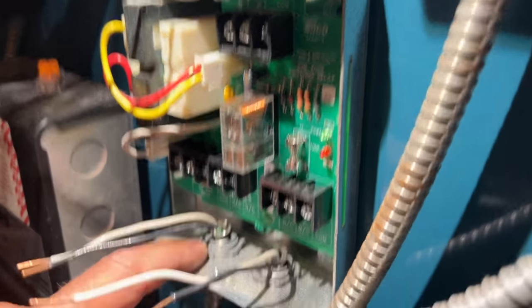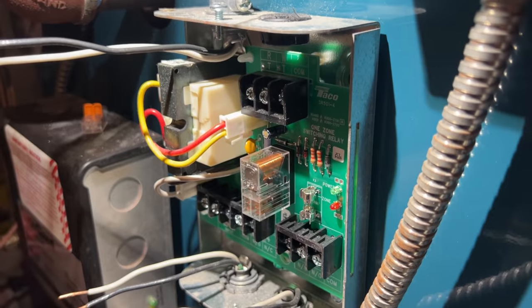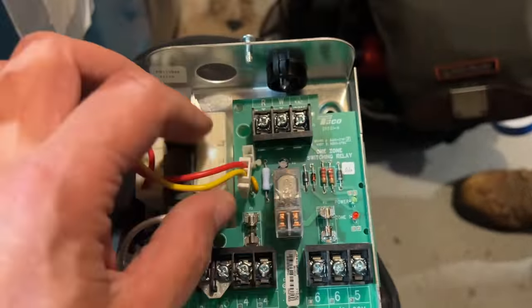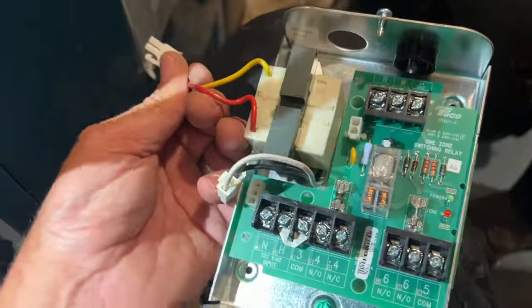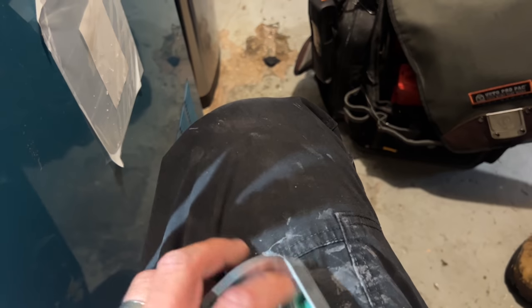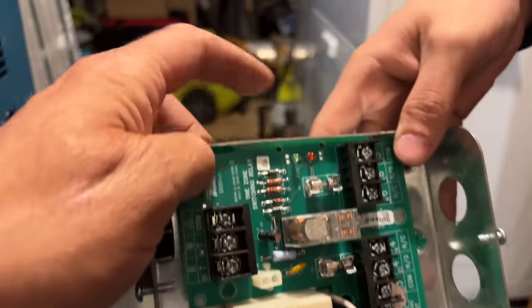All of my field wiring is disconnected from the board terminals. I'm just going to loosen up the three nuts on the BX connectors and pull this off the side of the boiler. Since the primary objective of this channel is to be educational and entertaining, let's take a closer look at the relay we just removed from the side of the boiler and see if there's any damage. I already broke these two little plastic connectors - I disconnected the low-voltage secondary wiring leaving the transformer to the control board and also the line voltage.